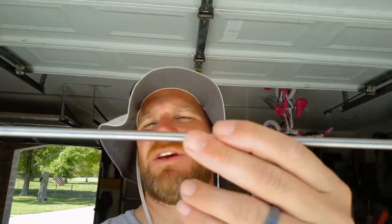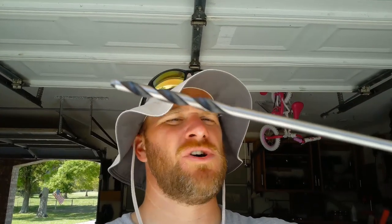Different day, but we're back at it again. It is much sunnier today — I need some shade, so that's why we're doing this. I know I'm going to get sunburned if I don't put this thing on. I need to attach it to the house, and the problem is I have these gutters — I can't just attach it to this end piece right here, it's just not enough. I can drill in through here, through the other side of the gutter and into that rafter. I'm going to be using this 5/16th drill bit — I bought it at Home Depot. It's about 14 inches long, so I'm able to get through the gutter and into the rafter easily without weird angles. One nice long drill bit — roll it right in there.